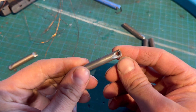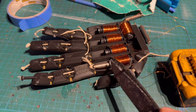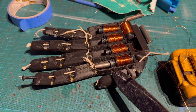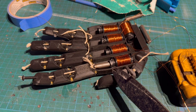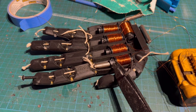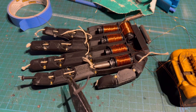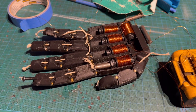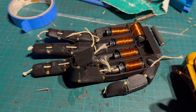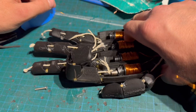I got the steel pins cut down and holes drilled in the ends — drilled by hand so accuracy isn't great, but they worked. However, while the rods worked fine, I realized I'd made a mistake I didn't predict in CAD: when winding the wire onto the coils, the drill was stretching the sleeve and the collars outward. So instead of the windings being 20 to 25mm long, they ended up more like 30 to 35mm. This means I don't have the right amount of throw — the rod doesn't travel far enough when magnetized to take the fingers from fully straight to fully closed. I didn't have enough wire left to remake all the coils, so to work around it I'm tensioning the fingers to be constantly slightly bent, giving enough travel to close and grip something at least.